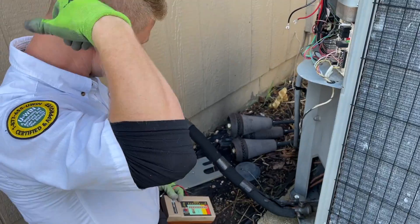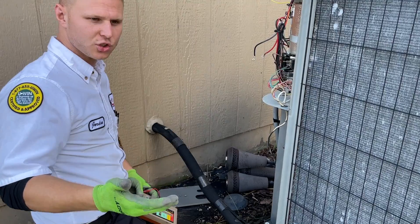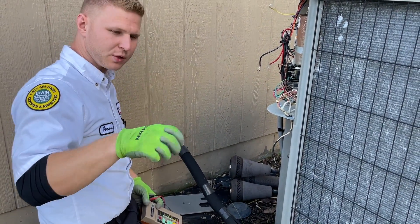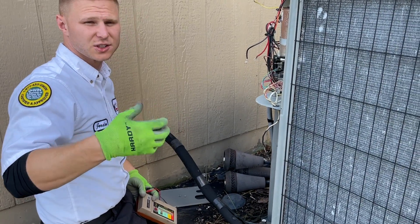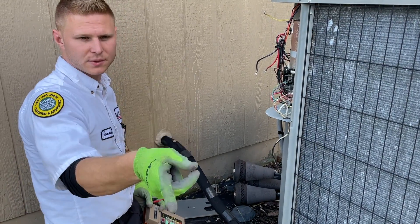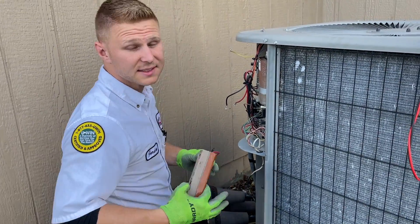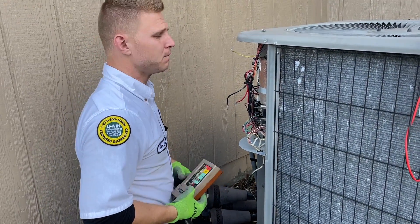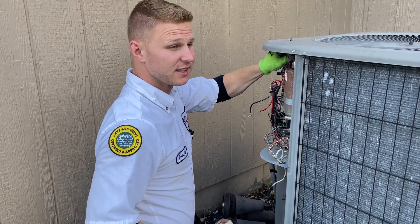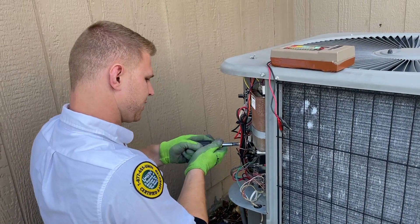This is basically telling me how close the wires are from touching or arcing to the shell. There's a sheathing and protection on those wires, and as that starts to break down, electricity can arc to the shell, which shorts out the unit. Because these are completely sealed, we can't get into them, so it gives me an inside look at what the condition of that protection looks like. If it's bad through the wires, I'll go in and check at the compressor.